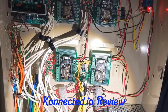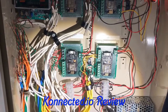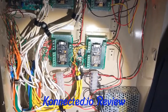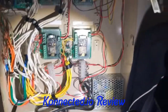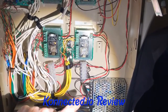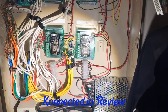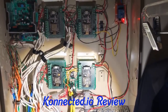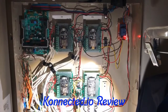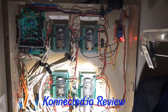One thing I'll do in the future is powering future keypads, which run Cat5 — I'm just going to run 12 volts to them and step down from 12 to 5 at the source. I'll also provide some sort of backup battery between the outputs. I had thought about putting a UPS in the whole thing, but haven't yet. Right now I have around 23 to 24 sensors hooked up, plus the siren.